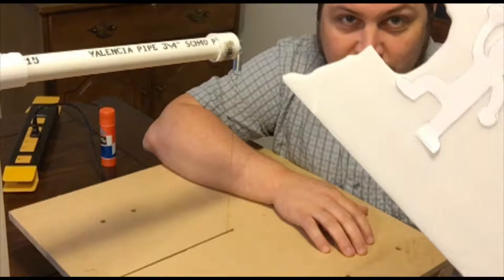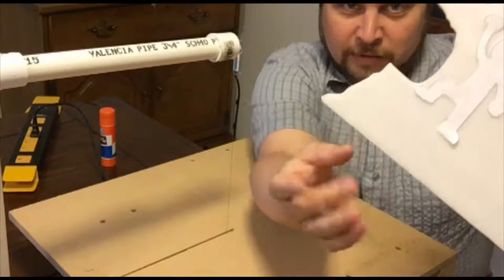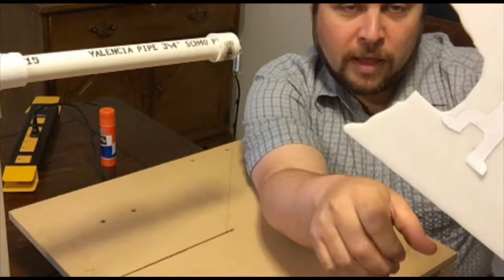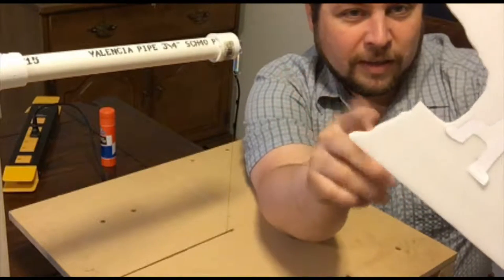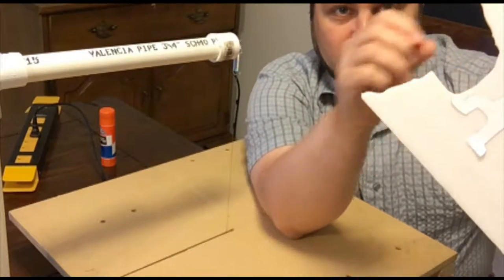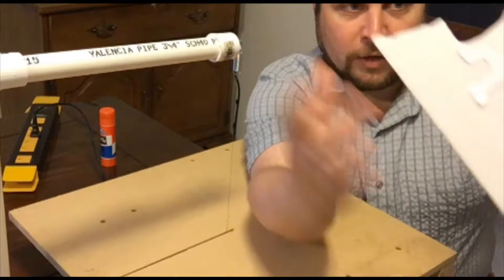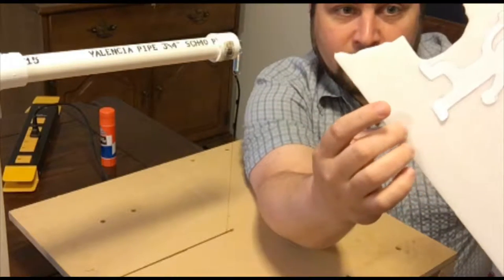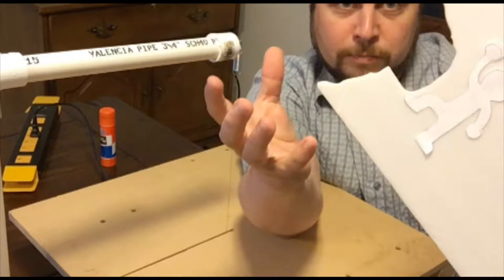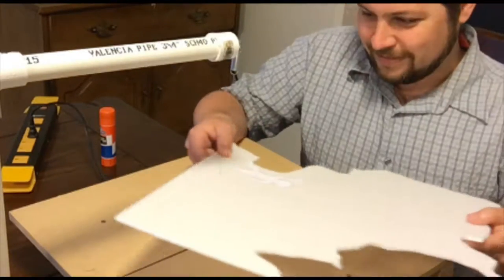You see that his feet are way off the edge, and I'm going to use the extra space down here to make my ingates for the aluminum. I'm just going to do that on two or three of these slices of foam, and then the rest will just be the guy by itself. I'm going to do a large gate for the hand, for the foot, and for the other foot, so that the aluminum has a good path into all the different high points of the sculpture.